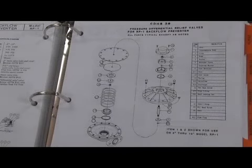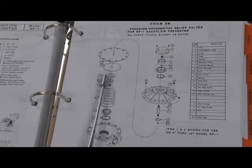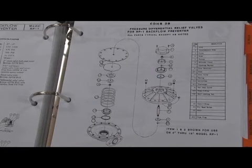The relief valve that was used in the RP1 and the RP1EX model was called a CDHS-20. CDHS-20 relief valve was different than the CDHS-14. A little simpler in construction, had a single external relief valve sensing line versus 2 we saw on the CDHS-14. Relief valve body on the bottom, relief valve seat screwed in right here, relief valve spring. We had our diaphragm retainer, relief valve disc, and we had an upper rolling diaphragm which helped act as a guide of the movement of that relief valve. So the CDHS-20 was used on the RP1 and the RP1EX series.